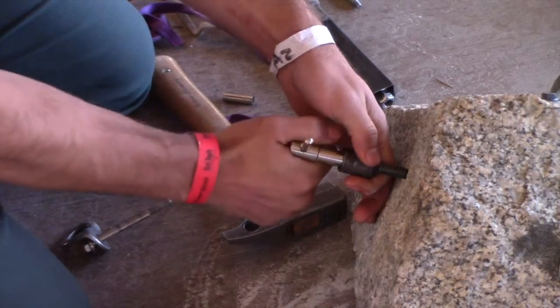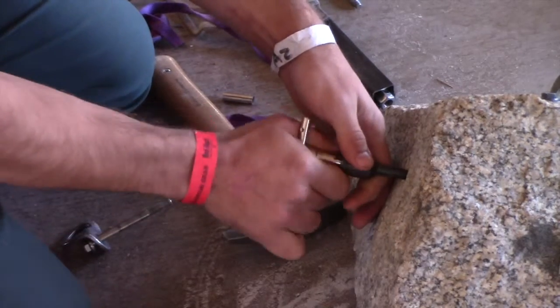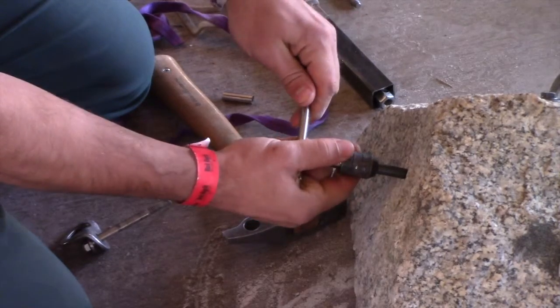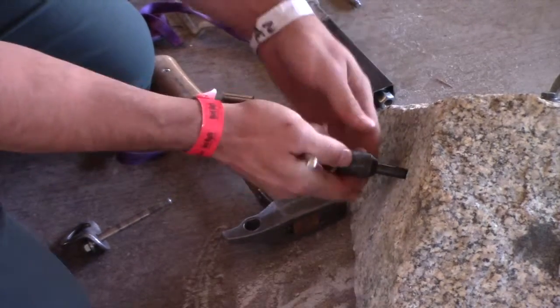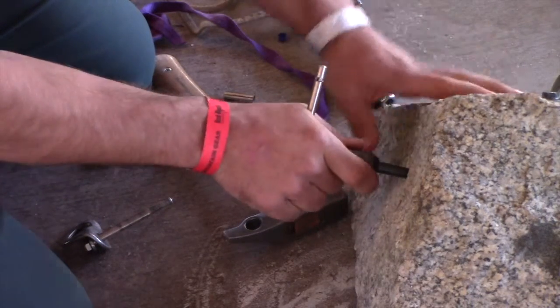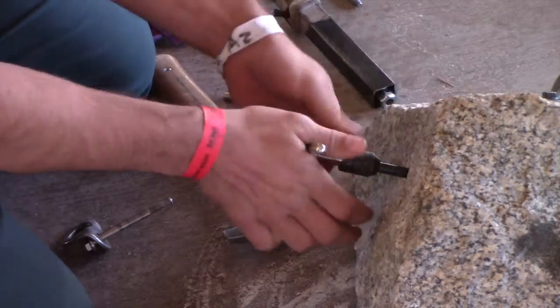Because you're creating a curl of metal in front of each of the flutes and it gets deeper and deeper, and when the lagging tooth hits the curl it gets really hard to turn. By going backwards you can lop off the curl and then you start again. That makes sense.